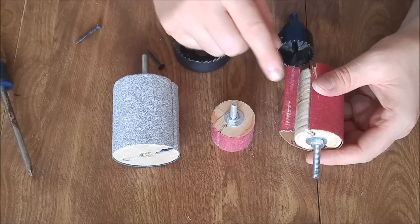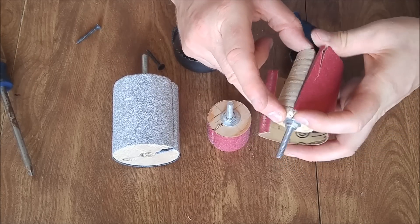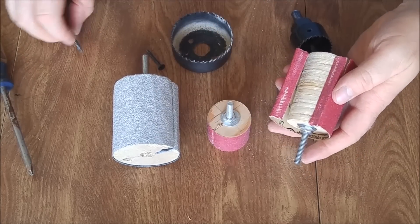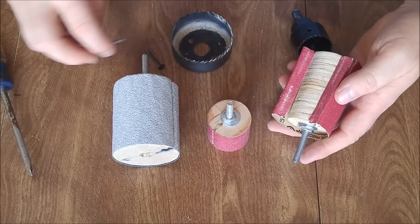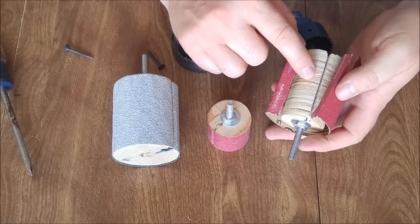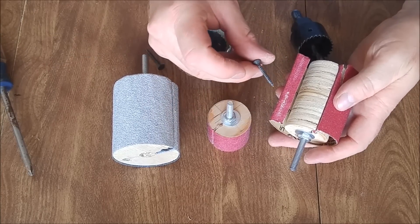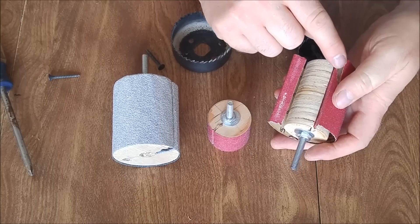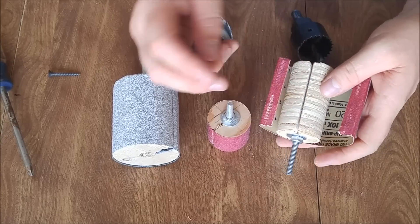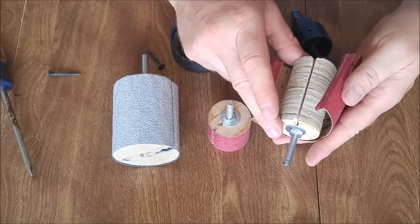The reason it's hard to get out is because, as you can see, there are grooves here from the sheetrock screw where the threads bite into the sandpaper and force it into the grooves of the plywood. So it naturally locks itself in there even without the screw in place. It's kind of a one-time install for the sandpaper, but it's easily replaced — when you wear it out, it's easy to add another sheet.